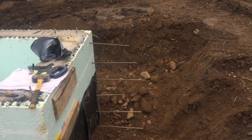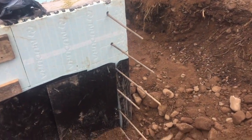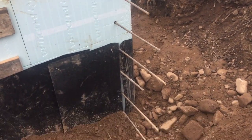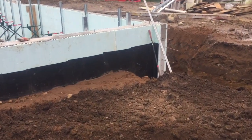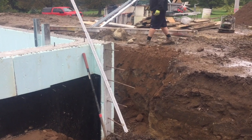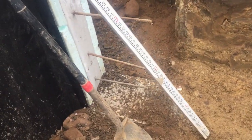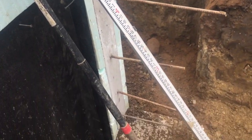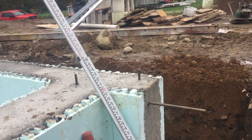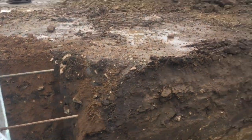We had to backfill all this so that we could dig. We like to stick rebar out of these walls for strength. Over here we actually bridged the gap with ICF blocks to bridge that overdig gap - six rebar sticking out of this wall, because this is full depth, and this is going to be frost wall. That's how we handle tying that together.